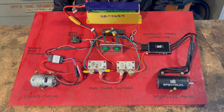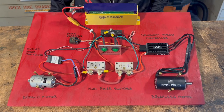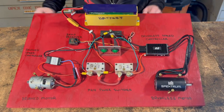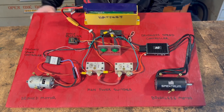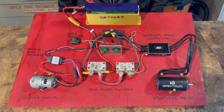The next legal requirement you have to have on a combat robot is an LED indicator to show that the robot is in fact powered up. When you turn on main power, your LED should light up to let you know that it's live. That's also a good indication when you turn power off that you have actually turned power off. This is a safety feature that all robots have to have.